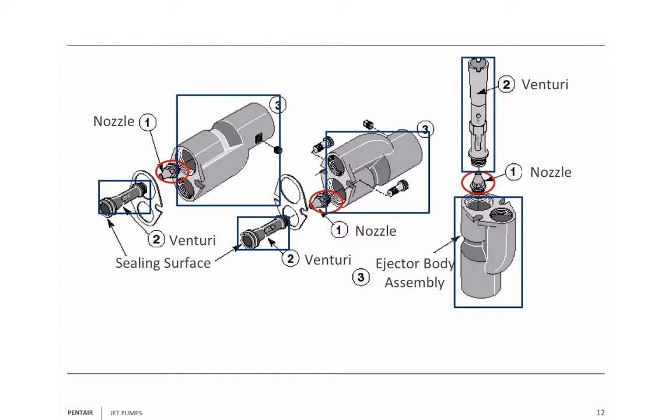The double pipe jet comes in a couple of different configurations. The two on the left are horizontal; the one on the right is vertical. The one on the far left has what we call the suction hole on top and the drive hole on the bottom — that's industry standard. Our SL and HL pumps are designed with that particular connection. We used to have a pump called the AL; the SL took its place with the same performance, but we changed the connection orientation.